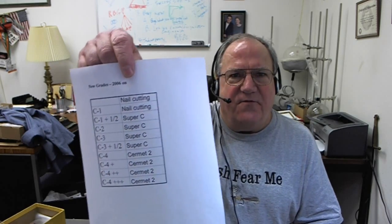Anyway, modern grades. I got started looking in the 90s, reading about how ceramics and Cermets were coming in for carbide grades. We originally started experimenting with true Cermets, and they worked really well in wood, but they were real hard to grind and could break — they weren't industry acceptable. This is an industry where when they say give me something exactly like what I'm using now but better, they mean exactly — no changes in how you run it, grind it, or braze it.